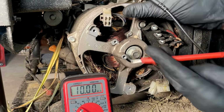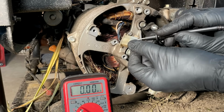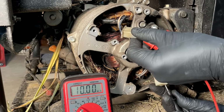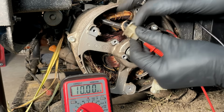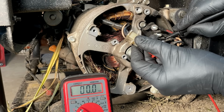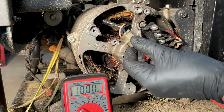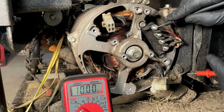And let's just check each coil against adjacent coils. There should be no connection. So we'll do DPE to sense. No connection to leg 1, leg 2. And the auxiliary windings, no connection. So looks like DPE is good. Sense winding, there will be a connection, I think, to one of the legs, which is normal. Yeah, and there's a connection on there. So that seems to be fine. Check leg 1 to leg 2, no issues.